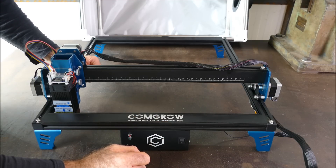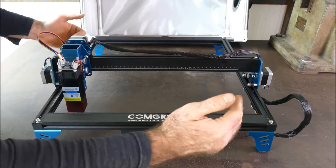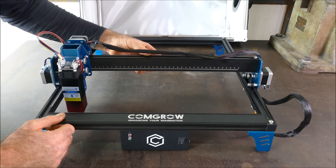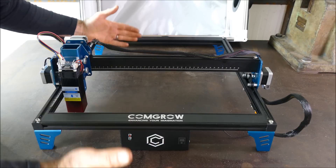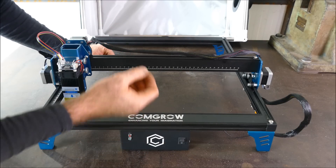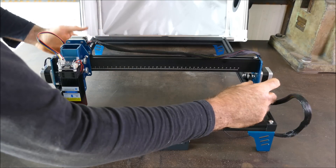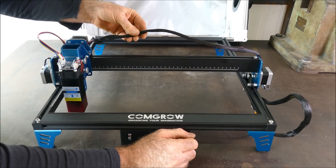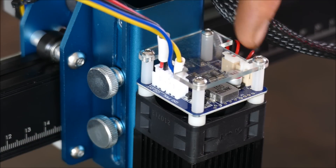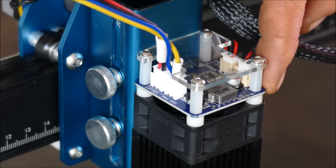Those separate motors are also handy if you want to expand the gantry. These are just aluminium extrusions and you can get them in two- or three-meter lengths, so you could create a much bigger or custom-size gantry. Since the motors are now independent, the only thing you need to think about is making a longer wire. To make this 10 watts, inside you have dual 5.5-watt diode lasers linked together with a mirror — that's how you get the 10-watt output.